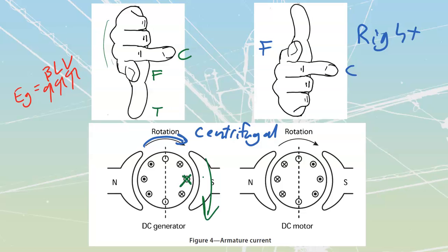I'm going to have current that is going to go through in the opposite direction over here. Well, how does this stop a motor? It's going to stop if we take a look at what's happening around each of these individual conductors. Right over here, we're just going to examine this one, where we've got current heading in. So we've established that this rotation and a field across there is going to have current heading in. So we reverse that direction of current.